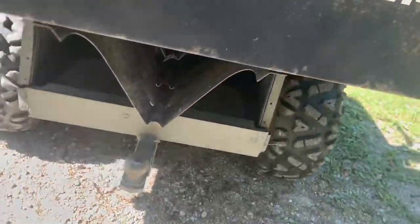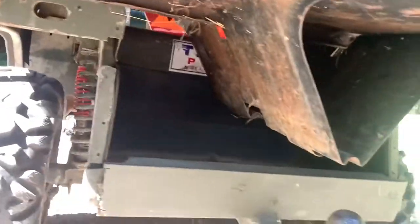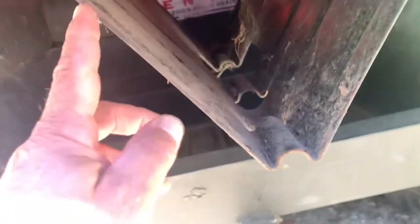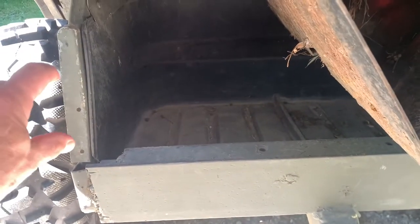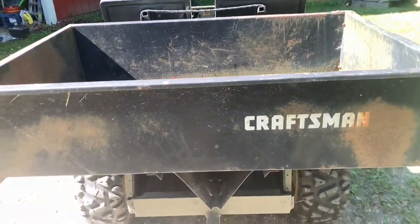And then with that hinge, there's the axle for the old trailer. It's just a hinge bracket. So we're gonna cut that off and then turn that 90, and it just fits in between this back of the cart. So what we're gonna do is either make a bracket or go through the frame, but probably just tack a bracket to that frame, with one large pin that goes through and puts this on. And that's basically it. That's a quickie.